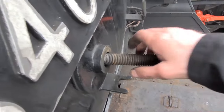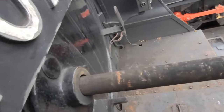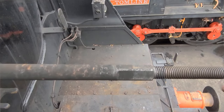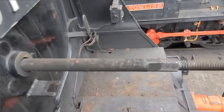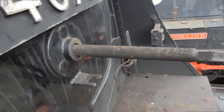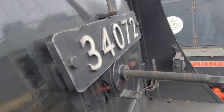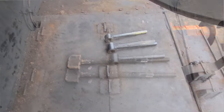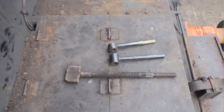This long spindle here, as we've mentioned before, is called a dart. You can see the threaded end, and then that moves on to the machined square part which the handle slides onto so it can be rotated to open the door. The leading edge of the flight of the dart has its corners rounded off to help it into the eyelets of the crossbar.